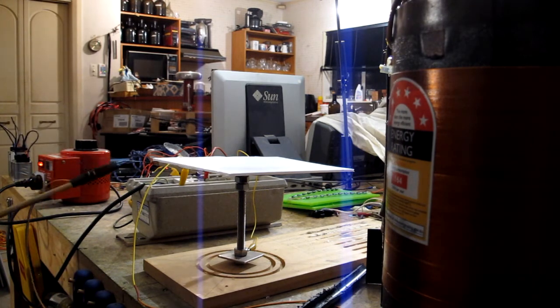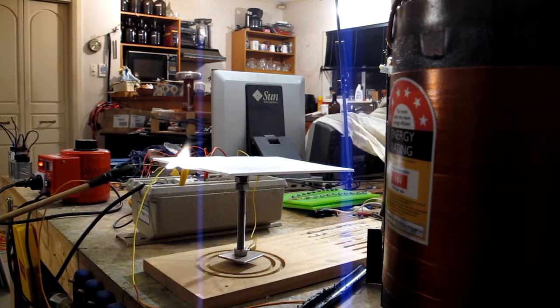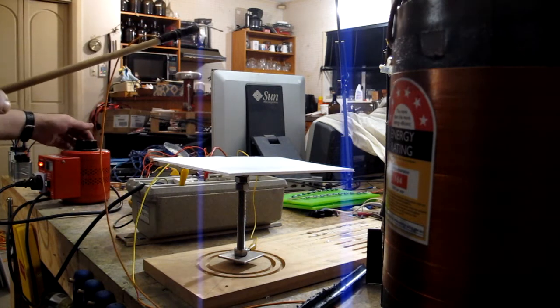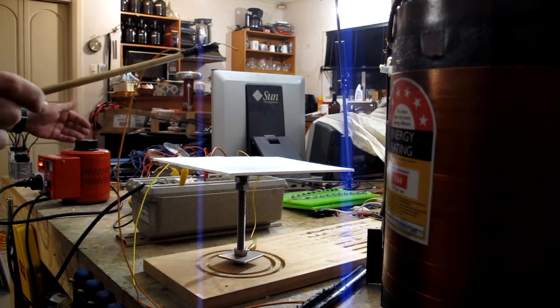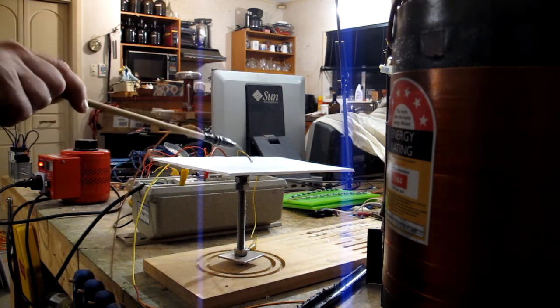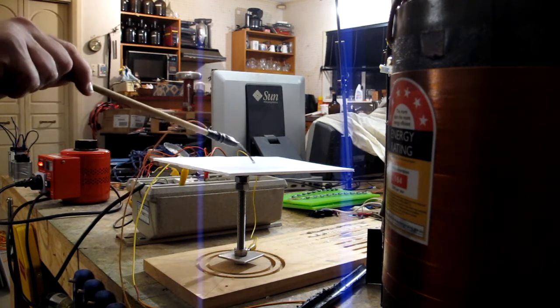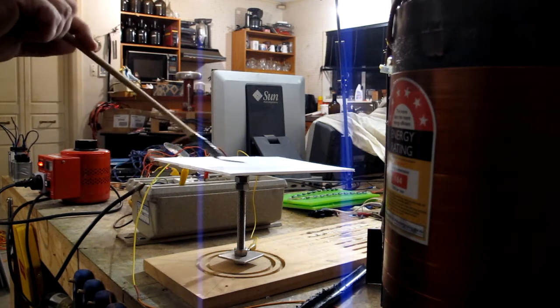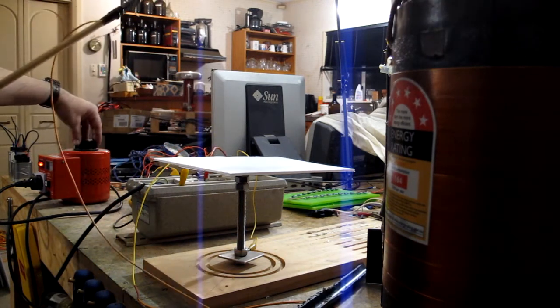You can see that through the air we've got a breakdown at almost a centimetre — there are very sharp edges there, so that'll be why it's breaking down so far away. But nothing through the plastic. And because the Variac will pump us up to about 252, 253 volts in, that'll be closer to 16kV out, and it's still not breaking down. Lovely — I think we've found our insulator.